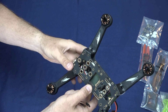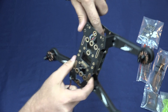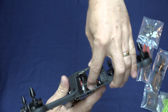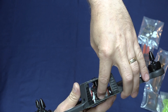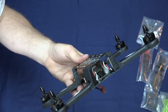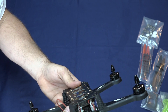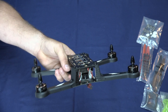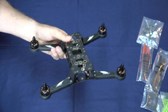If you look down here towards the front of the board, next to the audible alarm, there's actually a 12-volt pin there for your FPV gear — it can be hard to see. Now some earlier models had this already installed and a lot of people got confused and thought it needed to be plugged in — it does not. The only thing it plugs into is your FPV gear. If you try to plug it into your flight controller you'll run the risk of damaging it.